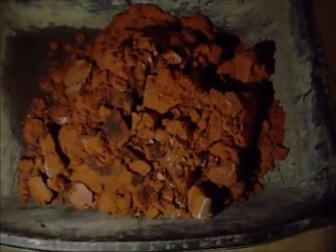Alright, so there's the burnt sand, in a little cake pan, and there's all the unburnt sand. You got a little bit, but not much. For the most part, that's unburnt. So yeah, we got a lot of burnt sand that we're going to have to mull. It looks like together about 15 to 20% of it ended up getting burnt. So definitely going to need to do something with a muller or I'll run out of sand quick.